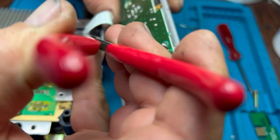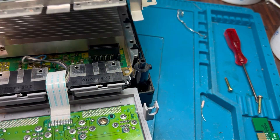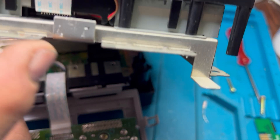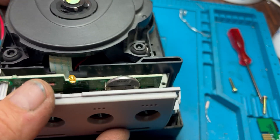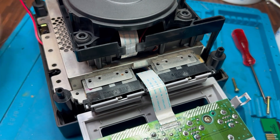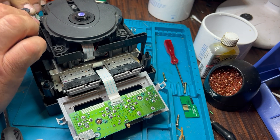When I revisited this, I installed LEDs into the controller ports, and I've also done a battery mod so I can change the battery when it goes flat. I had a few issues with wire routing — I had to bend a small steel flap up because it wouldn't allow the wires to come up from underneath. That let me get the wires routed nicely and neatly. Then it's just getting the many screws put back in along with the power supply and everything else, and we're ready to give this a go.